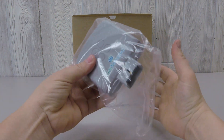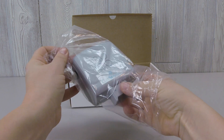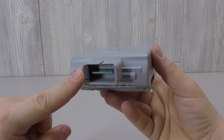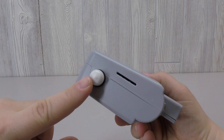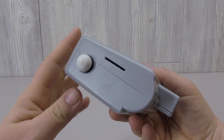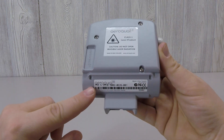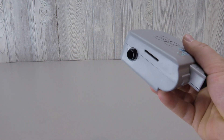Remove the sensor head from its packaging. This is the slot where the PM sensor is slid onto the sensor base. This is a white cap covering the sensor inlet. Lights that show through this slot indicate that the sensor is working. This is the sensor outlet, and this shows the serial number of the sensor. Always remove the white cap from the inlet before using the sensor.